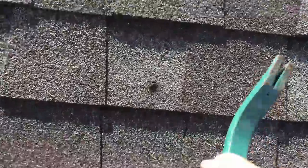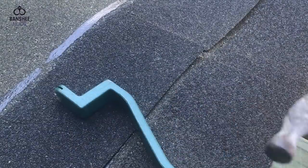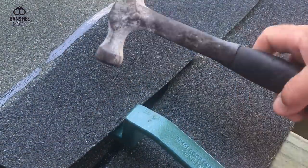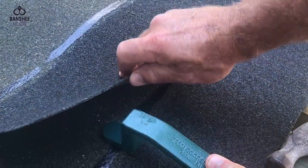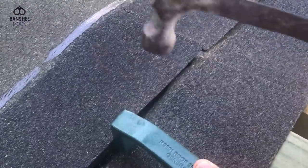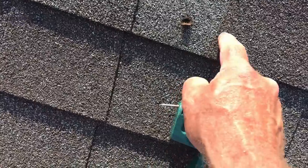The other cool thing you can do with this tool — it's called a roof snake. Here we go, let's show you how we do this. Take your tool, your snake tool, place the nail in the head, right? Put your nail where you want it and you strike the tool on the top, not the shingle. Get it down that far, then remove your tool and put it on top of the nail to finish nailing, and you're done. This handy little tool creates a perfect way to transfer energy without damaging your shingle.